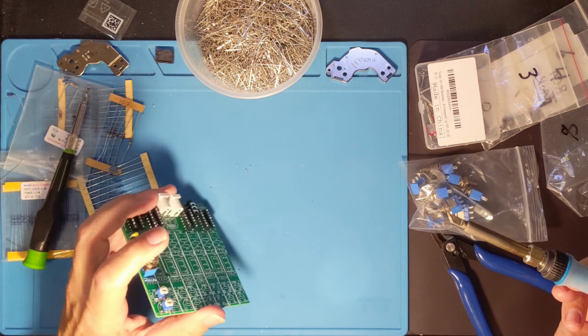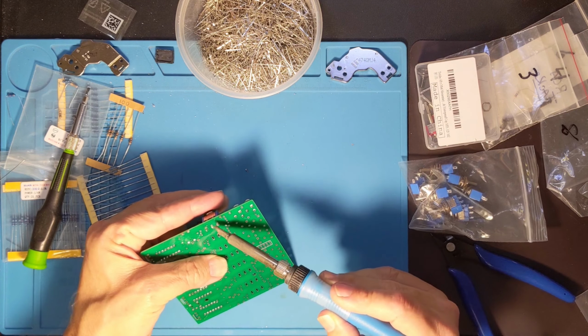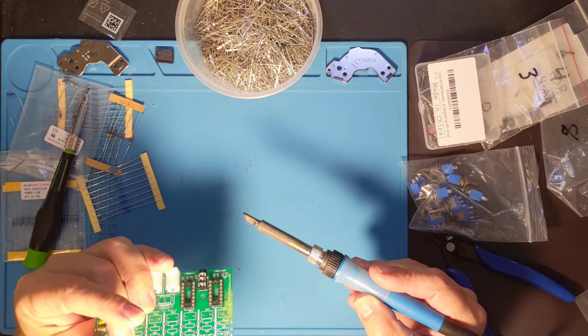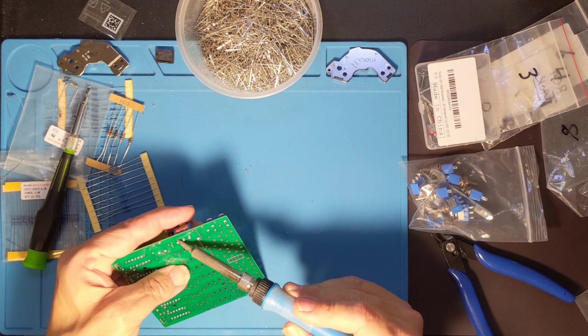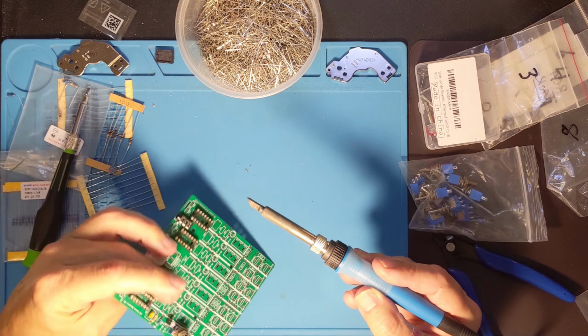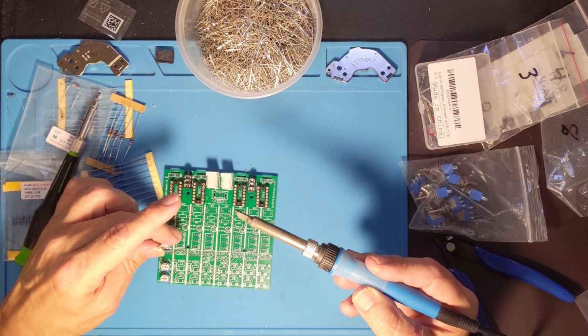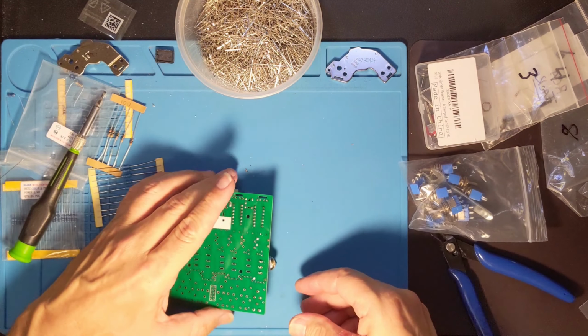So now the beauty is there's some solder there that I can use, and when I straighten this out, make sure it's seated properly, and then let the solder cool, and it's still wonky. So I've got to figure out how to get that to work right. That look reasonably straight? It could still be straighter. So we're going to keep trying. I'm not going for absolute perfection here, but I do want my switches to line up because there is another board that sits on top of this which captures the nut and the washer for this so that it actually holds it together as a sandwich and actually works as part of the case. So I do want to get it reasonably straight so it'll fit in. Now that's got one of them. Now I can go after the other two.